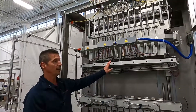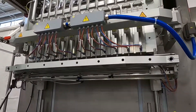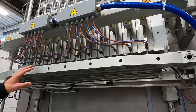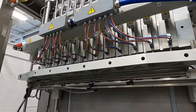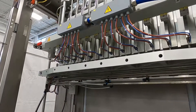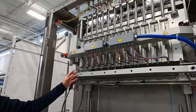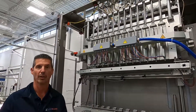As we continue down in our process we enter into our cross seal assembly. This is a drawbar assembly — it is servo driven and draws up and down. In this particular case, with a 270 millimeter long stick, it has a 270 millimeter long stroke.